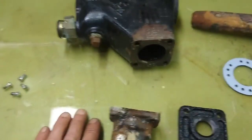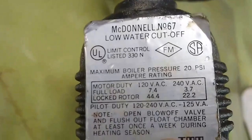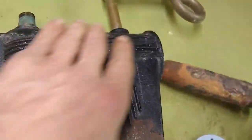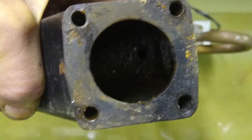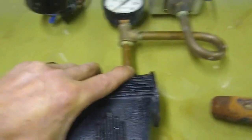Once I had that flange off, I looked up inside it. I'll show you the label on this thing — it's McDonnell No. 67, made by McDonnell & Miller ITT. I looked up inside there and it was all loaded up with barnacles of rust and scale that were preventing the float from moving.